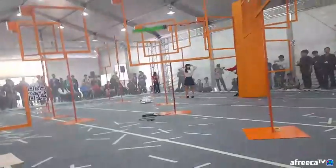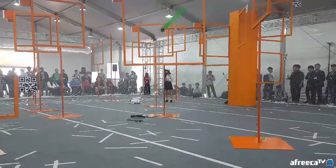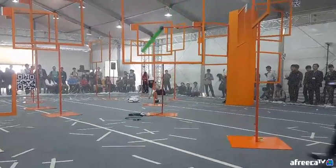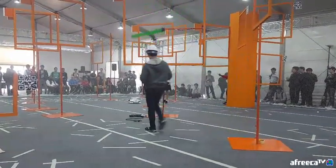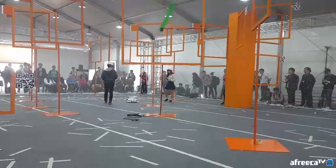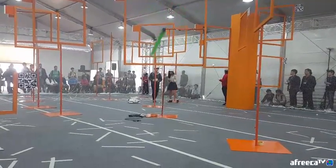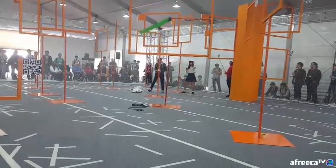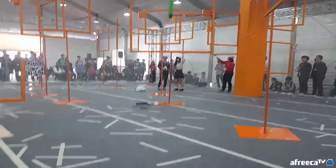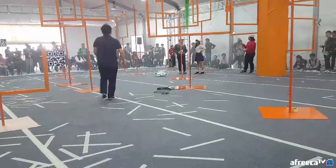So what are your thoughts about what you see here, the Coanda drone? I think it's fantastic. It looks very special, a bit like a UFO. The reason is it uses a special aerodynamic effect in order to fly. It has a ducted part on the top, and then it has the shape that you see, and the air goes past it. For creating lift, it's actually pretty efficient. But the typical disadvantage is that it's extremely hard to control.